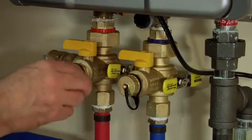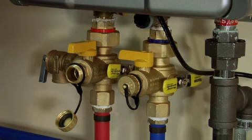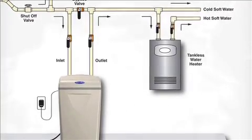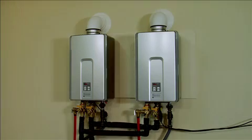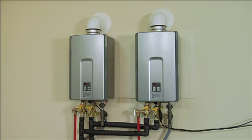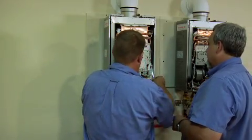The valves also enable owners to connect a garden hose to the hot water of either tank, set the temperature on the controller, and wash a car, deck, driveway, or even a pet with warm or hot water. In areas with hard water, consider a whole-house water softening system to protect and prolong the life of the tankless units. The crew also runs an electrical connection between the heaters so they can communicate and share the load. When owners call for hot water, one unit fires first; if it reaches 80% capacity, the second unit automatically fires up and both work simultaneously at 50% capacity. After 10 cycles, the units automatically switch that sequence. Finally, the crew connects low-voltage wiring from each unit to digital remote controllers in the laundry room and in the master bathroom.